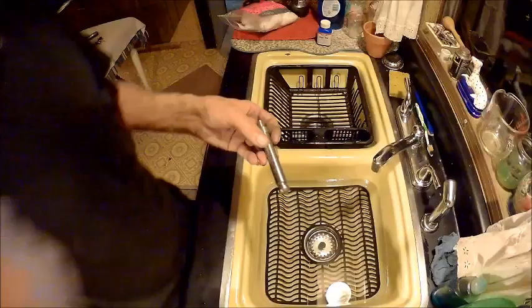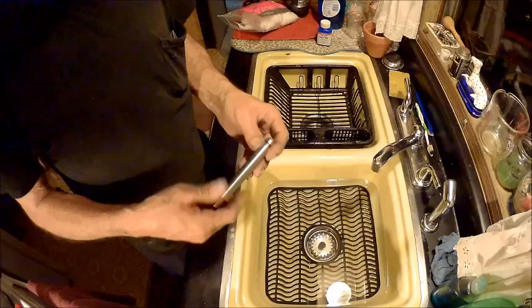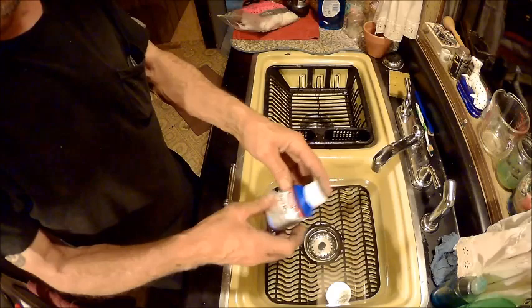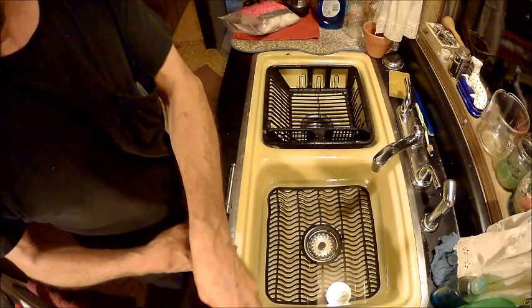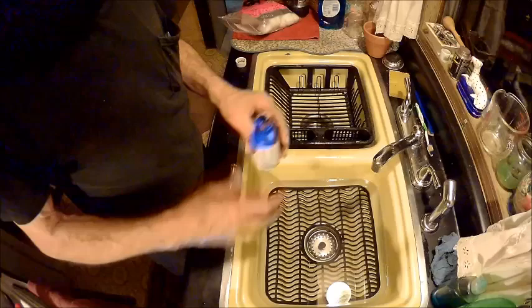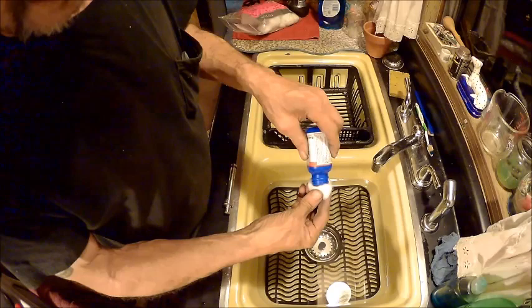Alright, so now we're here with cold water, and the cold water is to stop the bluing process. So first thing you do is you make sure it's grease free, which I've already done. Then we got our blue, super blue. We'll shake that up. And then I usually have about 4 cotton balls ready. Then we'll take a cotton ball and just squeeze that in there until you start feeling wet against these fingers. See how it's wet right there?